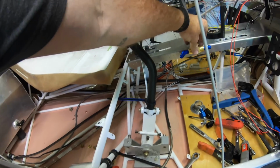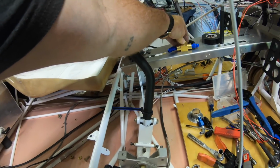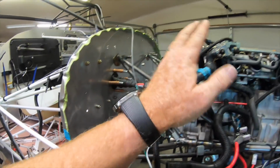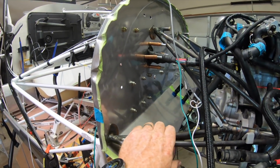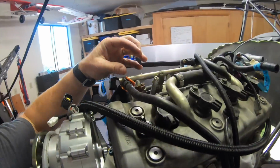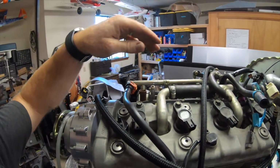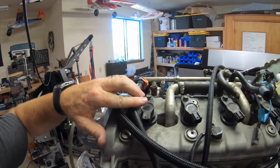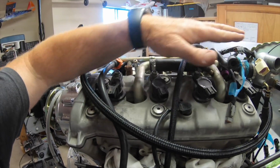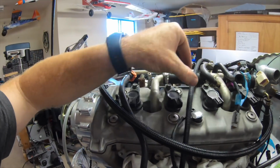It's going to have a 45 going into the fuel valve, and then from the fuel valve, run forward to the bulkhead. From the firewall forward to the engine, there's additional parts coming for that, and that's just basically to tap into this rail right here. Brian Dacus is providing in his AEM kit a rail that mounts on top of the coil bolts, and that's to run the fuel line.